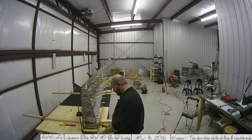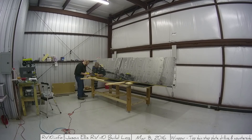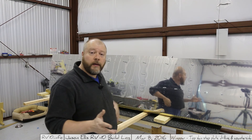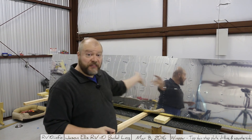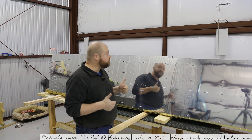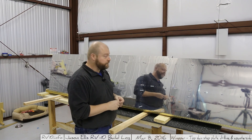One of those camera views was really far away - I'll do better about positioning next time. The hangar was closed because it was still thundery and nasty outside. All the countersinking of those doubler plates is done now. It's a matter of disassembling everything and then beginning the process of dimpling the skin. I'm going to disassemble, lay it out, set up my dimpler, make sure I have enough area to work in, and then dimple all the holes. Dimpling sucks, but disassembly first.